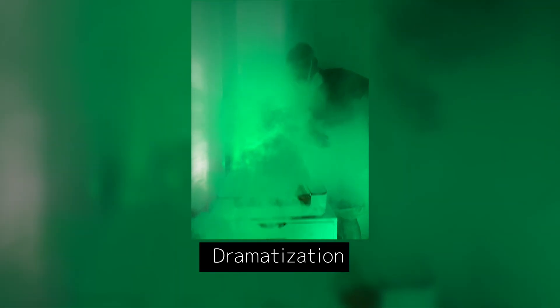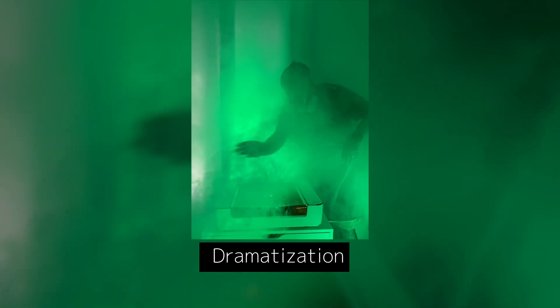The filter turning off too soon was a problem, especially when cutting acrylic. The acrylic really bothered me and hurt my lungs — I found I was really starting to avoid it. Since learning how to put the filter in manual mode, we're much less reluctant to use acrylic. We know we can get most of the smell out before we even open the lid of the Aura.